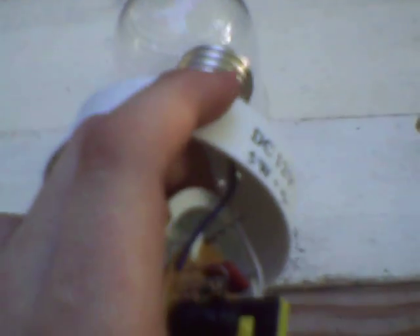The dot is the center contact, and the symbol indicates that is the shell of the lamp holder — your standard Royer oscillator. And the really big transistors, because this is much higher primary transformer current than a 120-volt lamp, hence the bigger transistors. This one is a somewhat simpler design than the lamp I reviewed earlier, because the base drive transformer is part of this — there is no separate transformer.